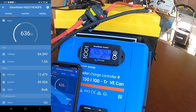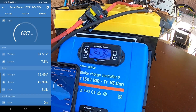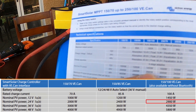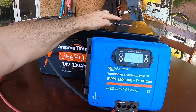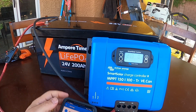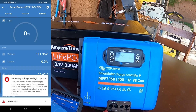Let's go grab a 24 volt battery and reconfigure the array for the full 2000 watts. For 24 volts, you can have — I believe it is 2800 watts. I have the 15100 — nominal is 2900 watts. We have our 24 volt Ampere Time battery connected to the charge controller. This is a 200 amp hour battery. I didn't do anything to the charge controller yet — we'll just see if it auto-detects the battery. Our voltage is going up. It looks like we have a battery voltage too high error, so it doesn't look like it will automatically detect once you initially set the unit up.